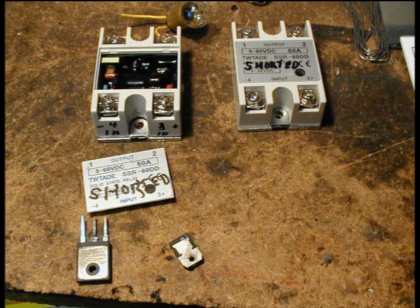After trying a few inexpensive and clearly fake DC to DC SSRs to control current to the 2500 watt heater, I started to look harder for DC to DC SSRs that might stand up to this service. Although I currently have 7 of them from 4 different manufacturers, I focused on the TW-TADE 60 amp version. I had one in the system for quite a while functioning flawlessly. Then one day, I mistakenly shoved a thick steel bar so far into the work coil that the current momentarily went well over 50 amps and the device shorted immediately.